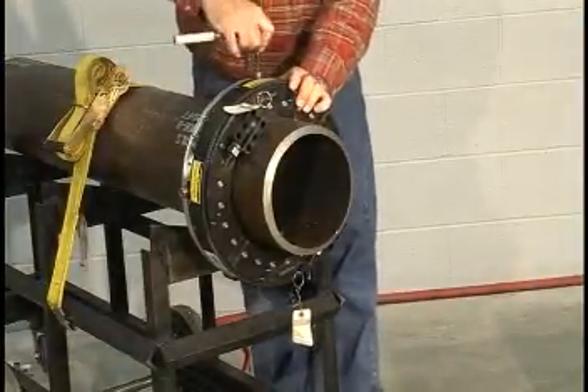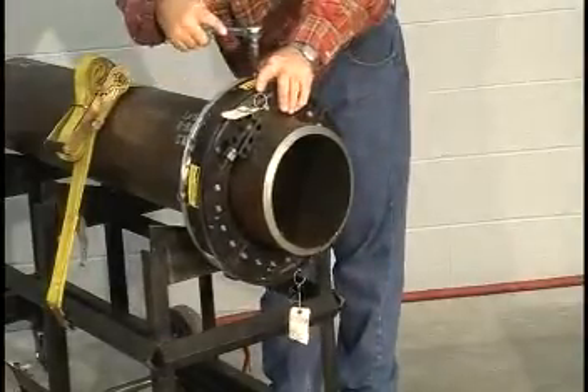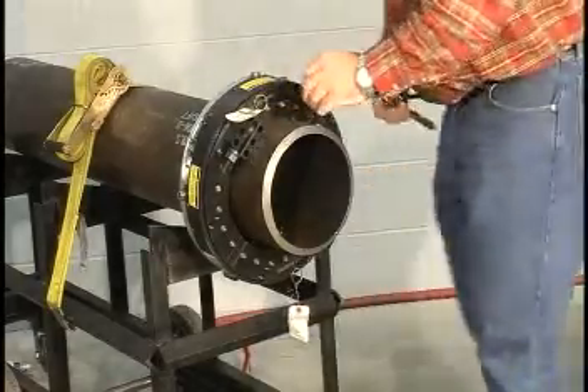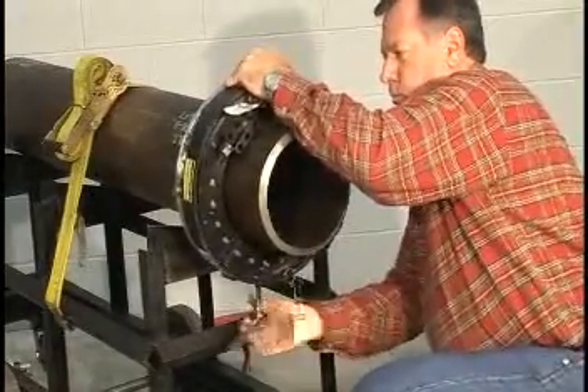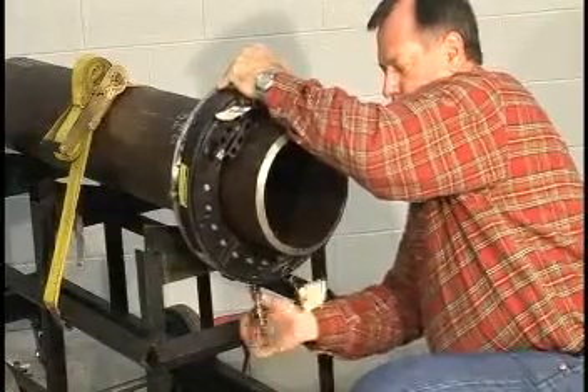The AFC series dimension is 5.1 inches or 129.5 millimeters. The locators are used to center the clamshell on the pipe and to lock the clamshell securely in place for machining. Once the clamshell is properly positioned, adjust the locators approximately the same amount to establish the rough centering.